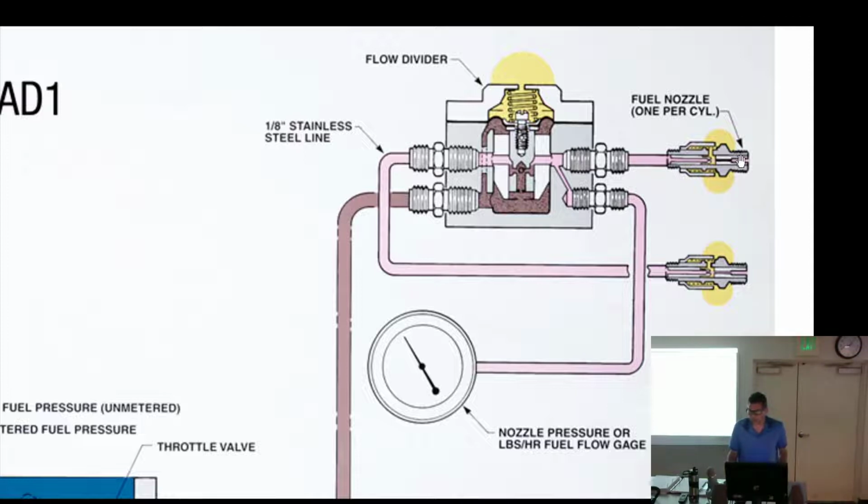If I partially plug the outlet of the fuel going out, what am I going to see? Would fuel be spewing out of your... Now, this is screwed into the cylinder, so a little turd got right there, a little booger. So would fuel go out that air? Generally, it could. Probably not. So we get a partial blockage here. That cylinder is going to not be getting as much fuel. So that cylinder will run lean. What will the pilot be telling me? High fuel flow. Okay.